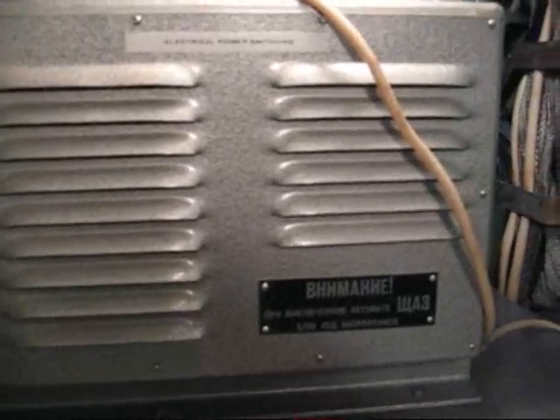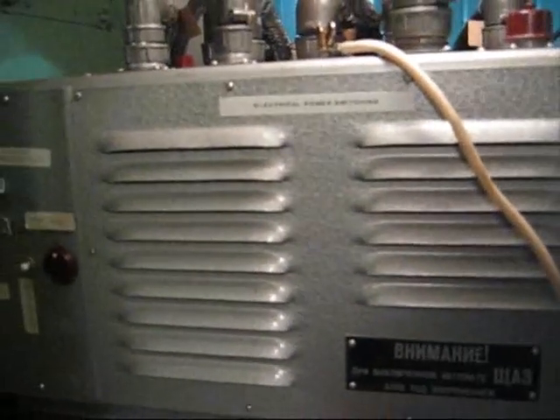The little box on top is the mains control panel. This has a number of relays and timers in there, including the timers which predetermine how long you have to keep the station running when you shut it down so that it cools down properly, and how long you have to wait before you can operate the station when you switch it on.